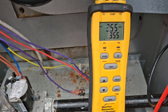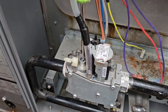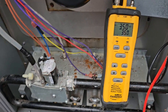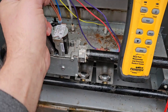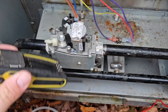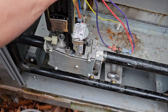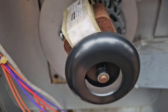All right — 3.5 inches W.C., that's pretty good actually. I'm going to lower it just a tad to 3.49. So everything should work once we get that board replaced. Always screw the outlet screw back in — please do not forget that.